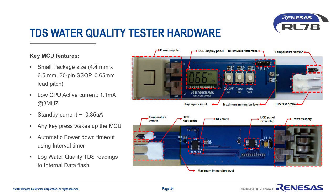Normally the MCU is in stop standby mode, drawing about 0.35 microamps typical with no internal clocks running. Turning on the internal 15 kHz low speed clock and enabling 2 cascaded channels of 8-bit timer only adds 0.23 microamps higher current drain. Then a long-term repetitive wake-up interrupt could be implemented, ranging from milliseconds to about 10 minutes.